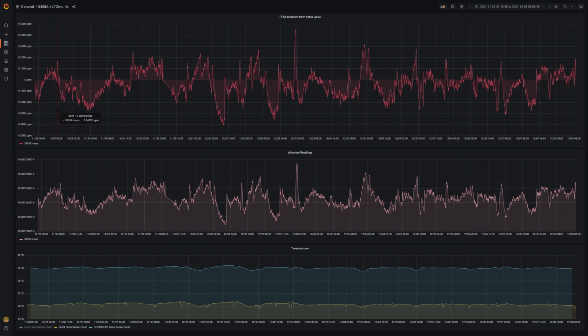And here are the wonderful results of that change. We are now staying within half a ppm, or in other words, we are maintaining the 24-hour specification for over 10 days. So about as good as the classic HP meter had performed before. This data is also from winter, where my ambient temperatures tend to be controlled a bit better, thanks to radiators and thermostats.